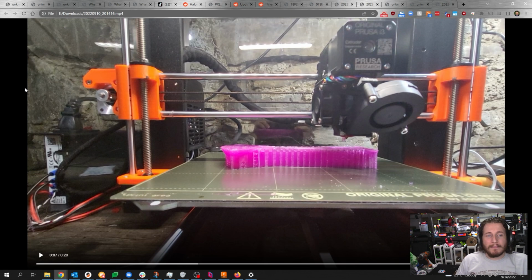For the astute amongst you, you'll notice there are reflections of light coming from the background of this printer. The printer is in a damn enclosure, and he is printing with PLA in a sealed enclosure. That, my friends, generally speaking, is a recipe for disaster. Your chamber is going to get so hot that heat creep is going to be a problem.